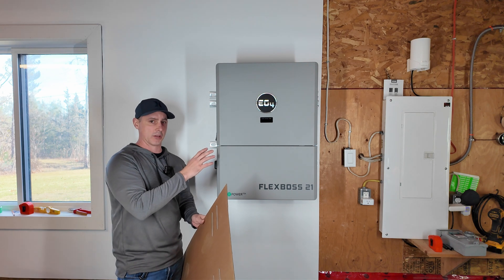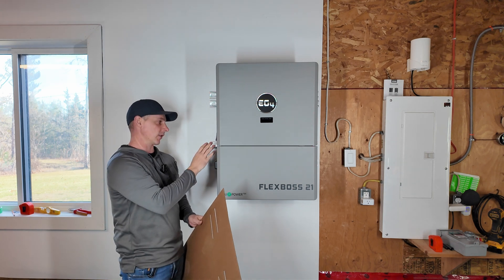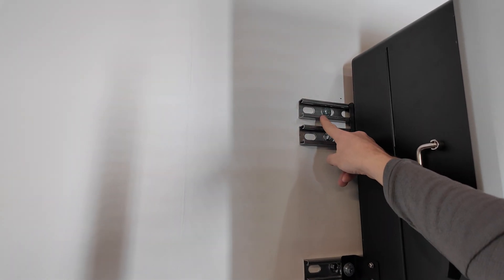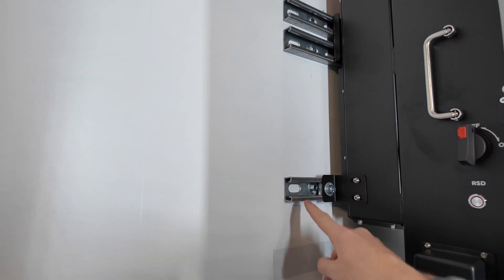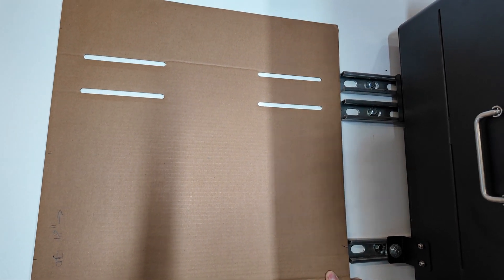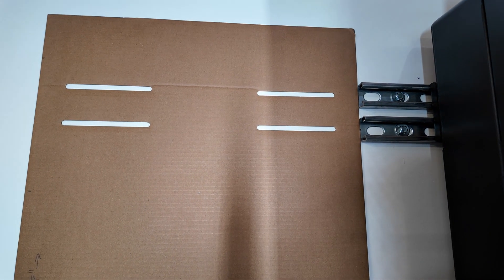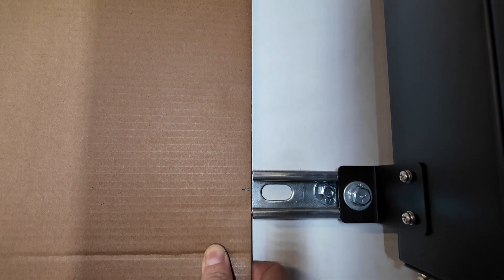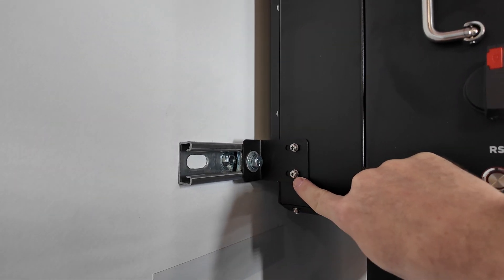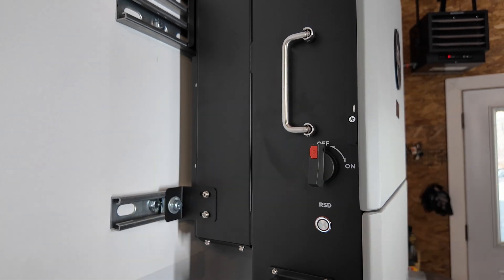It's kind of intended to be installed after — you put the top mounting points on and then put the bracing leveling brackets on after. But because I'm using unistrut I had to put it on first. As you can see, these are the two top struts and this is the leveling one to level the side. It would have been nice if they had put that mark on the template for people. These two take the full weight of the unit, and then this lower one has a slider so you can adjust it away from the wall to get it perfectly level.